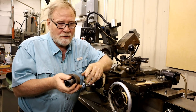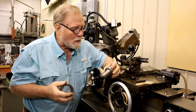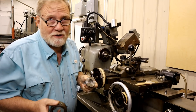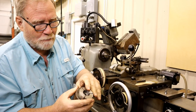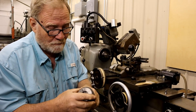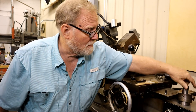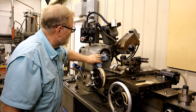One more thing before I go: in one of the previous videos that showed Bob, I was using this large collet, and one of the guys said there's supposed to be another part on there. So I started digging through and he was right — I found it. This threads onto the spindle nose and puts pressure on these larger outer-diameter collets in the right place, so now that all works. Thanks for the tip — Bob appreciates it.